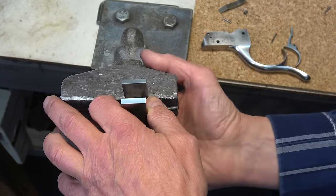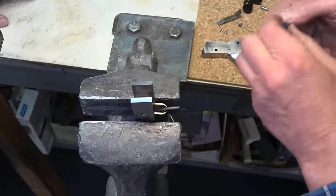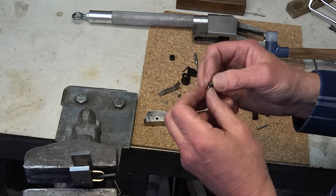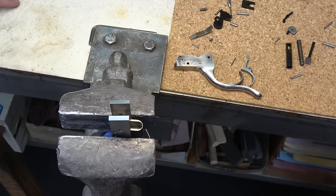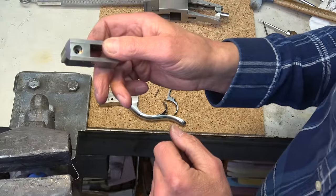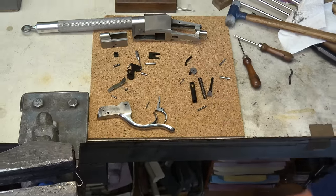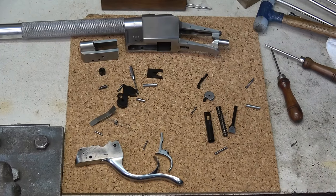Out it comes — could fly on the floor so be careful. Here you have the firing pin bushing, which is heat treated. Here's the spring, and you can see how the spring sits on it. This is basically it — the Hagen action completely disassembled. After heat treating, you always pull that firing pin bushing out before you heat it, because if you don't, it might seize in there. I know one guy who heat treated it without removing it — it was a big mess to get out afterward using EDM.